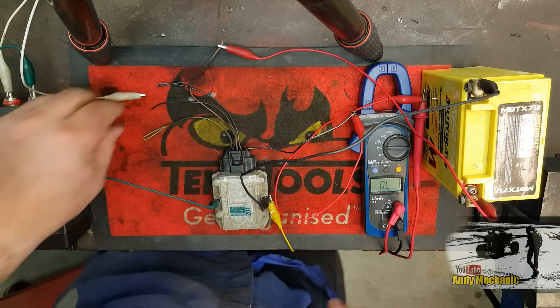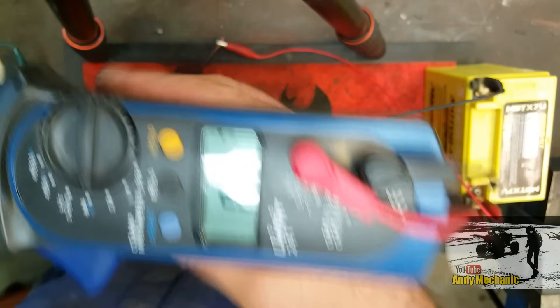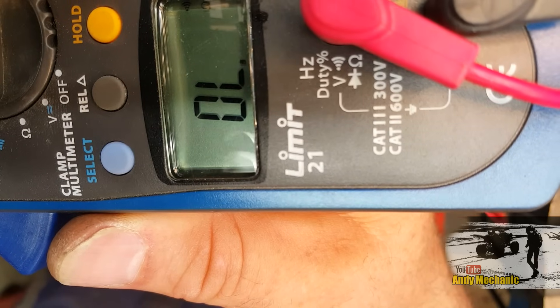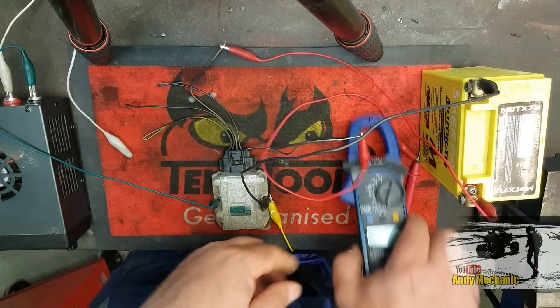Just to prove what's going on, I'm going to rig up an oscilloscope. You can just hear a bit of noise in the background but the continuity is pretty ambiguous, isn't it — a bit hard to tell. So we're going to pull that meter out and rig up an oscilloscope, which will allow us to see that conductivity over a very short period of time and prove the unit's working properly.